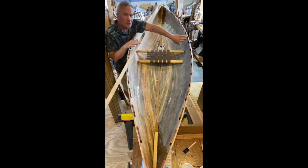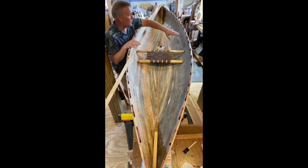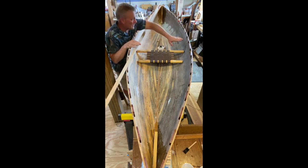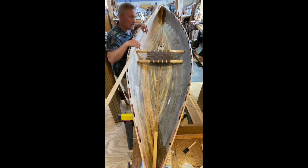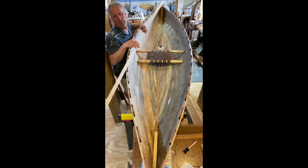I've done up to here because I was putting these on this morning. So this afternoon, I'm going to go in, do my brush width, and then go through and get all the edges so that they're all sealed. Then when I do my actual gunwale strips, I just ran these through the planer. They're just slightly under a quarter inch. I think they're 5/32, so I actually used a digital caliper on those. And again, this is the white oak. I think this is about the thickness I want, or the thinness I want.